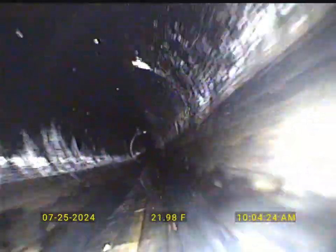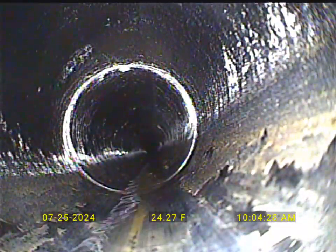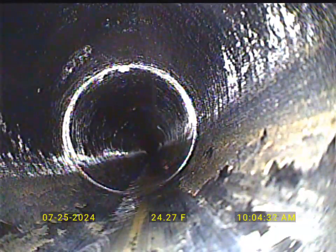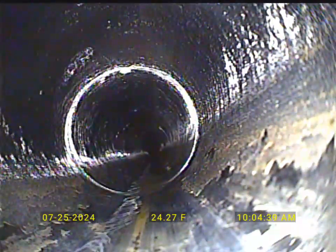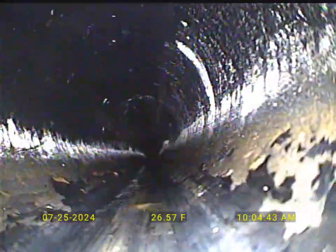I do have water running. What I look for mostly in pipes — this kind of pipe especially — is joints that have come unglued. See this glue joint come apart right there. Also pipe that hasn't been bedded correctly, or trenches that weren't backfilled correctly.